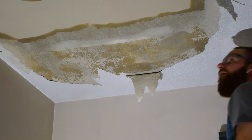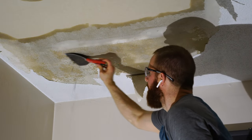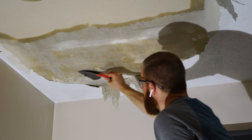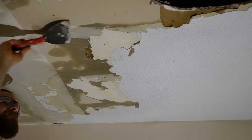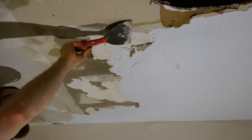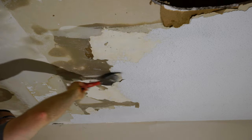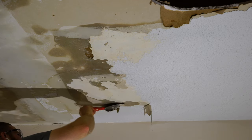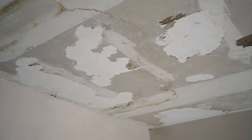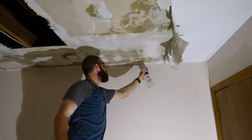Make sure to be cautious over areas that have drywall mud or drywall tape, because you don't want to ruin those joints. After going through this process, don't be surprised if your ceiling remains damp for 10 to 20 minutes. Most of the time removing popcorn ceiling texture is a breeze, but where it becomes trickier is wherever there's been a patch or an area that's been painted over — those areas are more resistant and you may have to scrape harder and spray a lot more water.